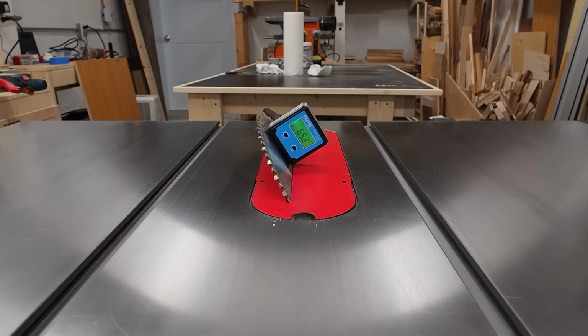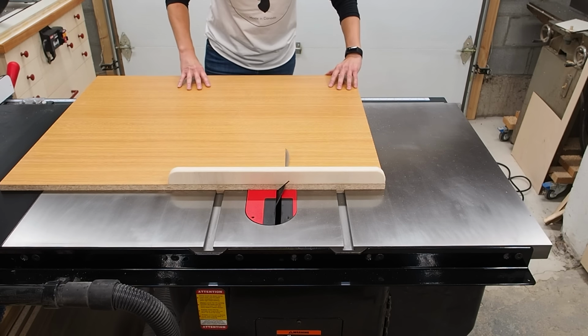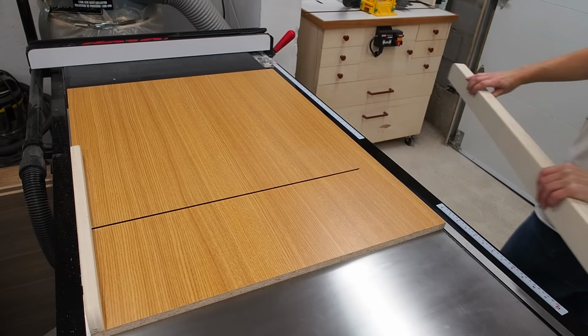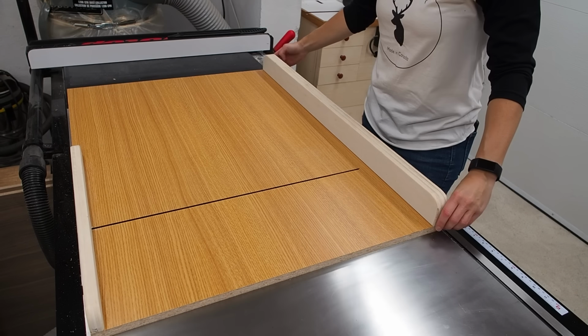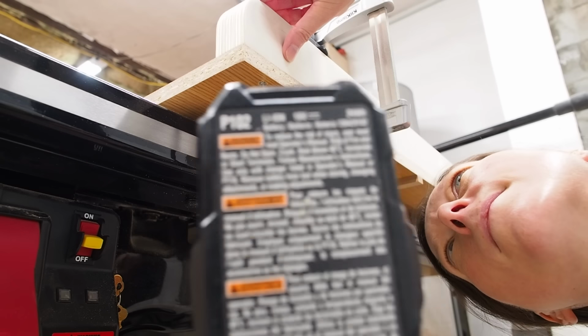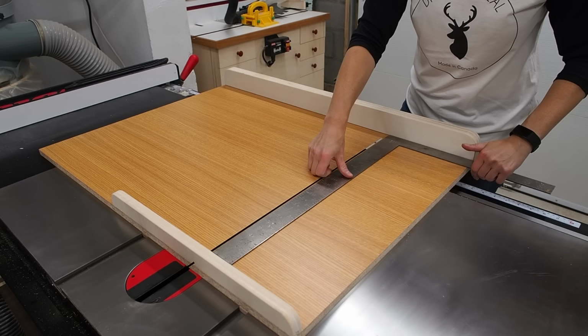And once the bridge is secured, I can set my blade to 45 degrees and cut a partial kerf, stopping just before the edge. For the main fence, I layered 2 pieces of plywood to make a beefy fence that would stay dead flat. There's a dedicated video on my channel for this sled if you want to get all the details, and I'll leave a link to it down below.